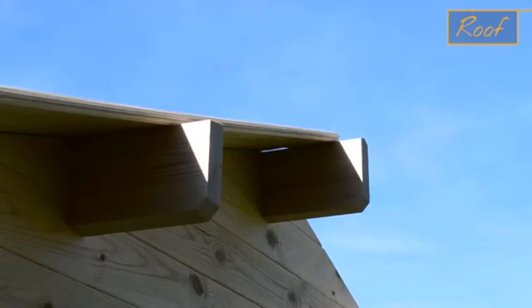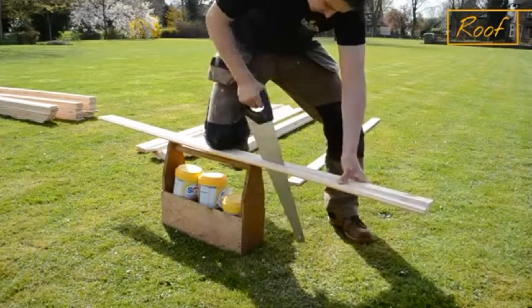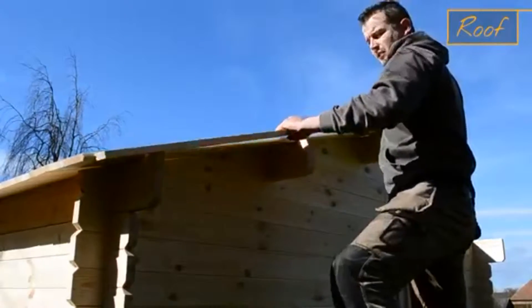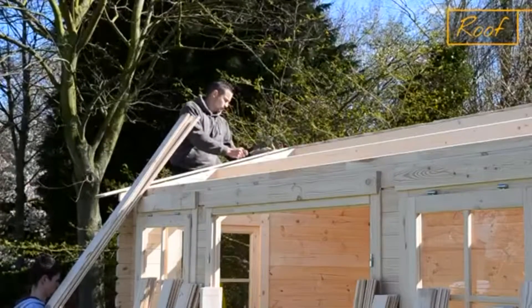When you reach the end of the roof you'll be left with a gap, requiring you to cut down a board to fit in the same manner as the floor. Mark out the required size and cut away the excess using a hand saw or electric jigsaw. Don't worry about the rough appearance though — this will be covered by the felt and fascia boards. Repeat this for the other side of the roof, ensuring that the boards are flush at the end and nailed at the top, middle and bottom.